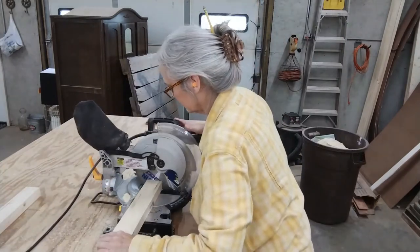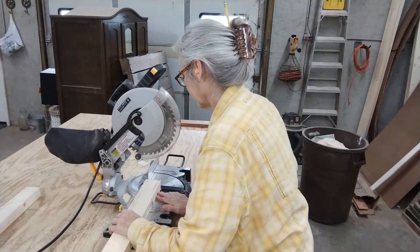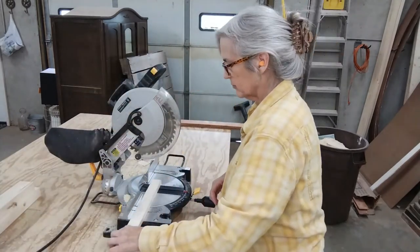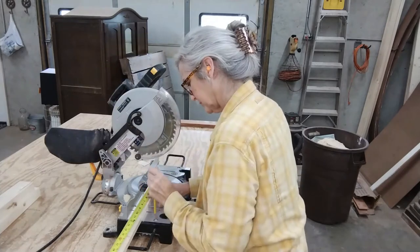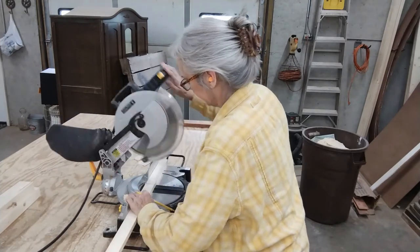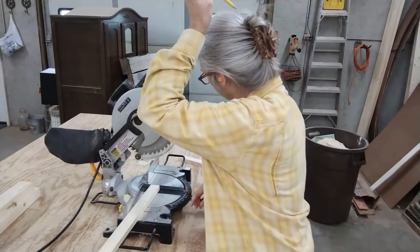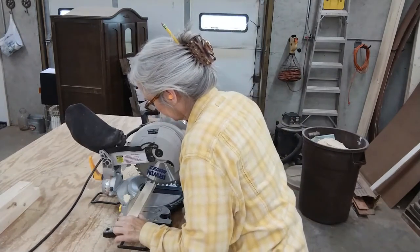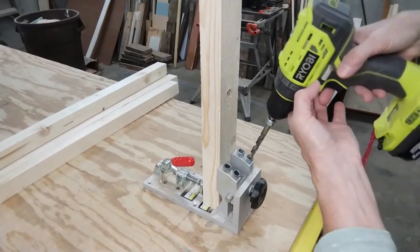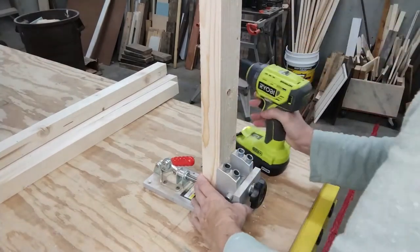The leftover pieces from that 2nd leg, I used as what I call stretchers. Basically, they're going to hold the legs together on the long side of the box. So it's going to be 28 inches wide, and then I had some smaller scrap trim. I see this is the 1x2 material that I originally cut, but I ended up going with a 2x2 for the sides, and they were 10 inches long. And then when you add on the dimensions of the legs, the 2x2s, which are actually 1.5 by 1.5, it's about 30 inches wide and about 14 inches deep altogether.